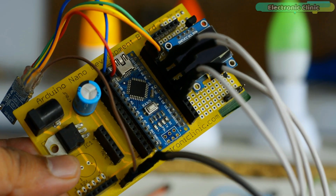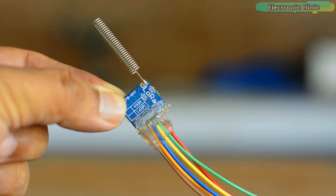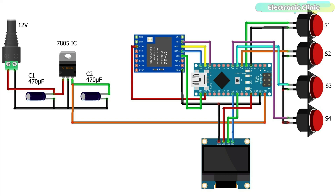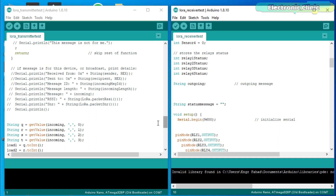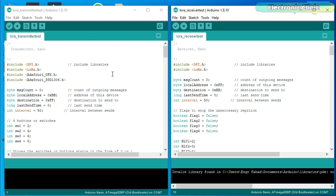The components and tools used in this project can be purchased from Amazon — purchase links are in the description. The SX1278 LoRa module connection with the Arduino remains exactly the same as in my previous LoRa-based projects. Four switches are connected with Arduino pins 2, 3, 4, and 5. On the left side is the regulated power supply, which accepts a wide range of input DC voltages between 7 and 28 volts. On the receiver side, the four-channel relay module is connected with Arduino pins 2, 3, 4, and 5, while the SX1278 LoRa module connections remain exactly the same.